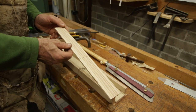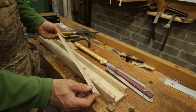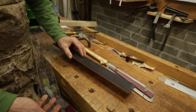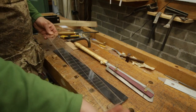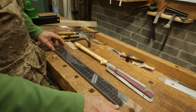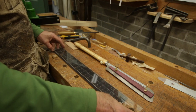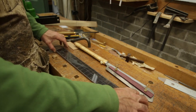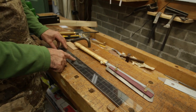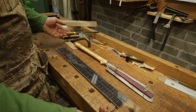So long as you put that little chamfer on the same side of each line, it's all going to index out just fine. The fret system we use is sort of a happy medium at best — it's never quite right, and especially with banjos it's never quite on the money, but it's as good as we get conveniently. Another little fret innovation: if we look at this fretboard here — I'll flip it over so it's dark — I've got this plexiglass fretting scale I created. The whole point is really for planning. There's an outline of a fingerboard on here with the fifth-string cutaway, and I can use it to juggle around on a piece of fretboard material to find the best-looking grain, or eyeball where I want to put inlays.